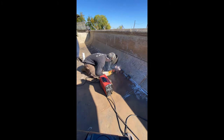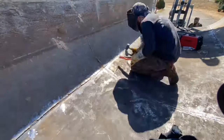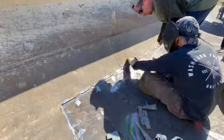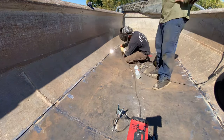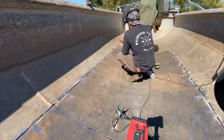I mainly use it on heavy equipment stuff. Now that we got everything laying flat for the most part, I went back around and welded in between the stitches to completely seal it off. As you can see I put a few more dog and wedges down throughout this process because some areas just didn't want to go, while others would go down fine with just a little beating from the hammer.